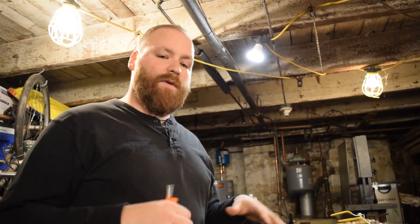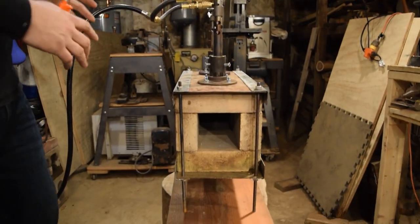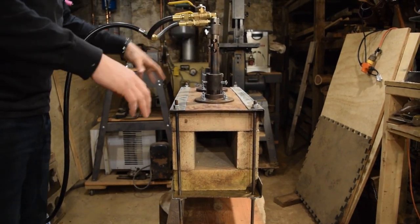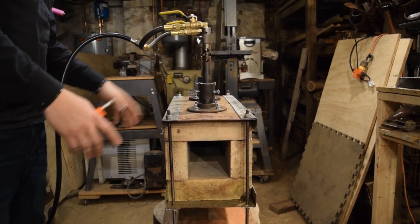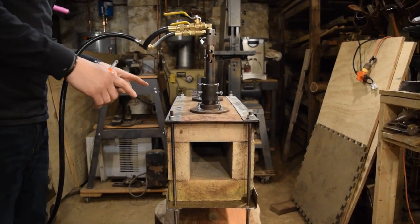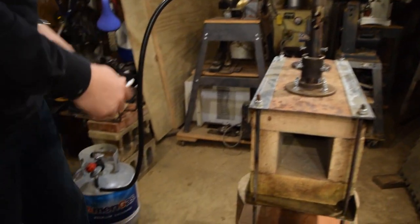All right, guys, our next step is to do a couple normalizing cycles and then do a quench. And for that, I'll be using my new forge. This forge we actually just recently built and shot a video of. So if you're interested in that, you can go back and see this made out of refractory bricks and angle iron and threaded rod. And it's all done with things that you can get from the hardware store and make at home. The only thing I did purchase are these two burners. But if you want to see that video, we'll put a link in the description below. So I'm going to go ahead and light up the forge, and we'll start on the normalizing process.